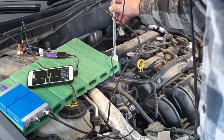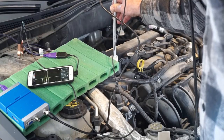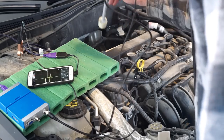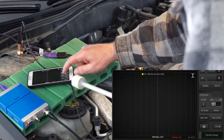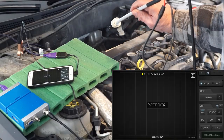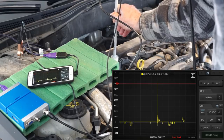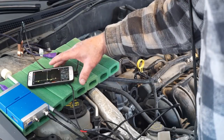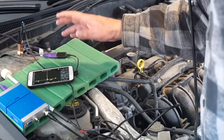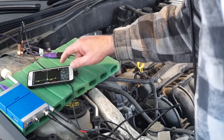I want to show you something that I cannot do on the 6022: a single capture at 1 mega sample per second. I'm not usually big on taking high sample rates, but let's try this. It's scanning, waiting for the signal — bring it close to the coil. At 1 mega sample per second, it took a single capture. Pretty nice. On the 6022, I can't use a high sample rate like this to capture a single shot. The 482 is the only one doing it at this high of a sample rate.